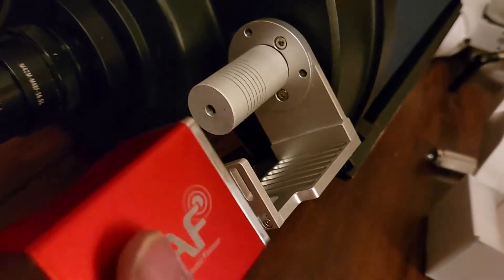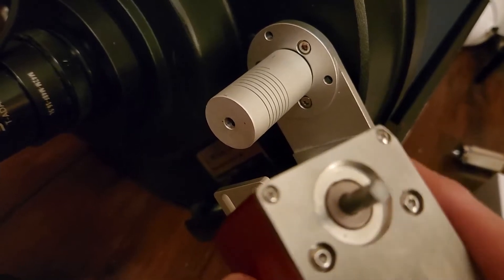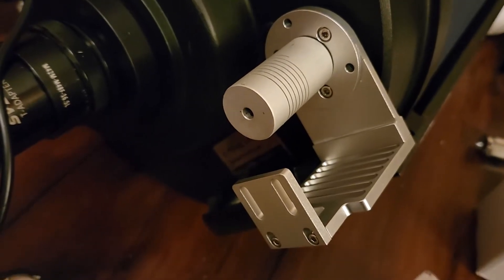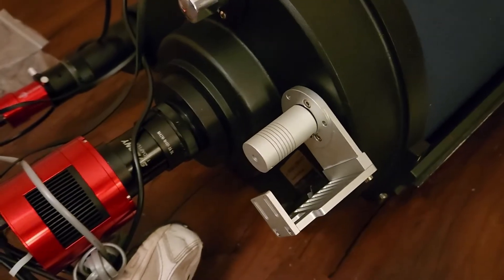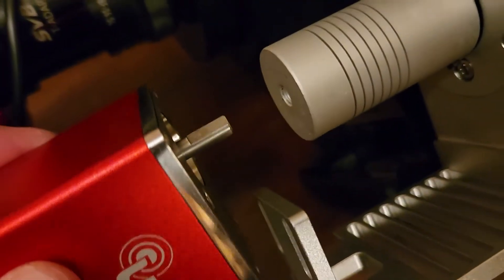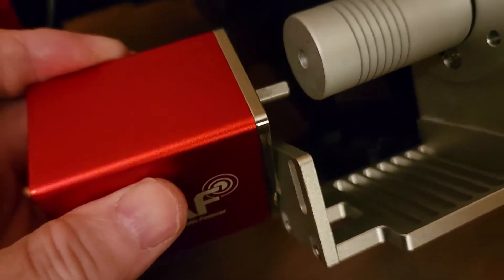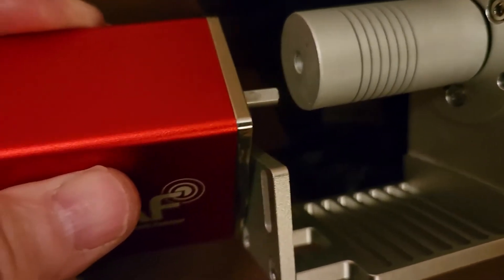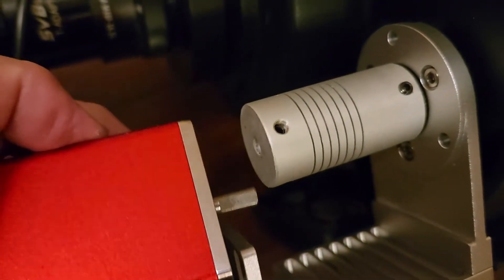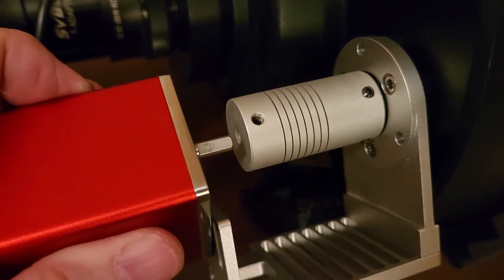The coupler will mount to the back of this with the motor shaft being in the smaller hole of the coupler, the other end of the coupler. One thing I forgot to mention: when you go to install this, it's a good idea to install it so the flat on the shaft is facing in whatever direction you can reach a grub screw on the coupler. The first time I put it on, I had it on the bottom, and that just makes life harder.